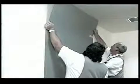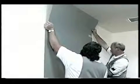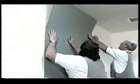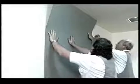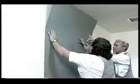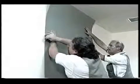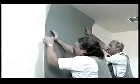You'll need to snap a chalk line along your plumb mark. Initially, we'll use this line to line up our material. Eventually, we'll use it as an adhesive line as well. Next, we have the material in place. We'll draw a second line using the edge as our guide. We're not quite ready to spread the adhesive, but when we do, you'll want to spread the adhesive in between and top to bottom, but do not go over either adhesive line.